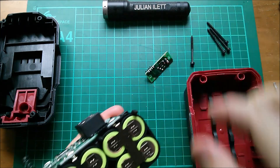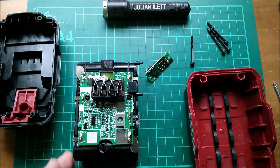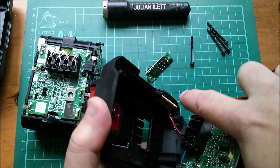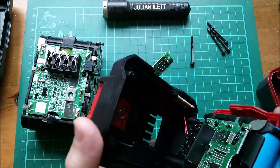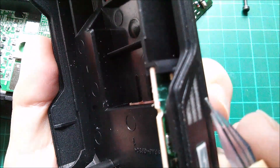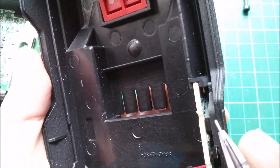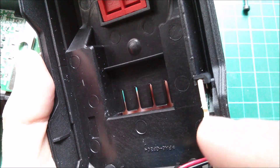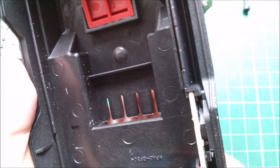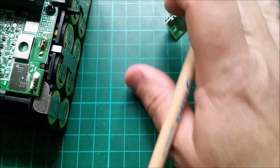That's really nicely done. In fact, I'm going to open the old battery to compare. In the old one it's very different - there's a pair of wires running up to a board which is up in a groove on the lid. Under these illuminated covers there's a light guide plastic molding, and the surface-mount LEDs are actually sat up inside it. To get the board out you'd have to bend it away from the plastic molding and then slide it up out of these grooves - it's really hard to do.